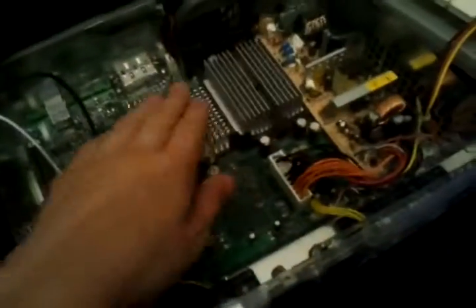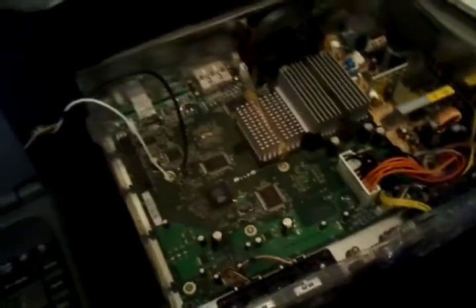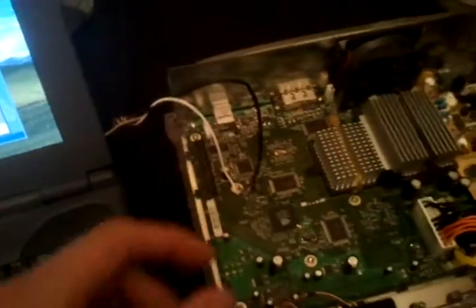Reading the EEPROM is more reliable because when the PC restarts you don't have to redo the Xbox hot swap process. Once you get the EEPROM off of this, you don't have to ever worry about the hard drive failing, because if a hard drive fails you can just get a new one, burn it with Xbox software, put the password on, and you're done.